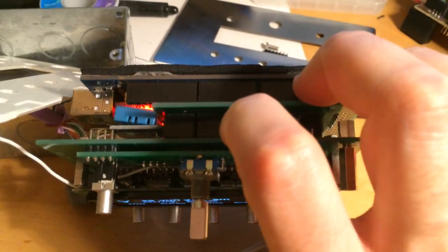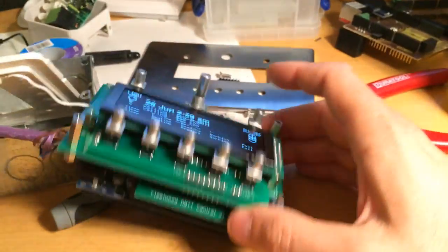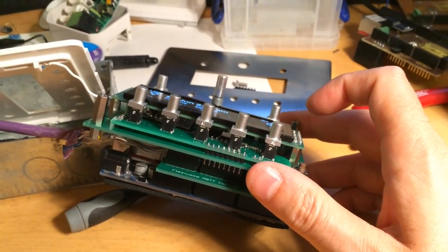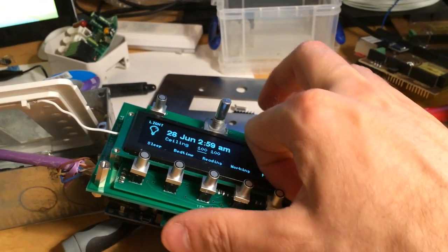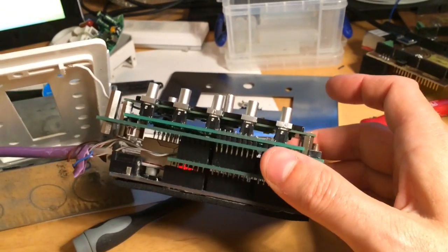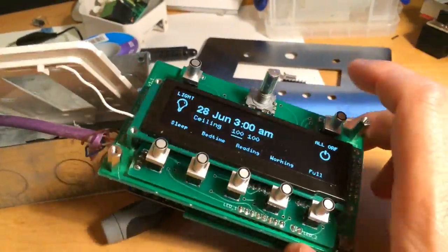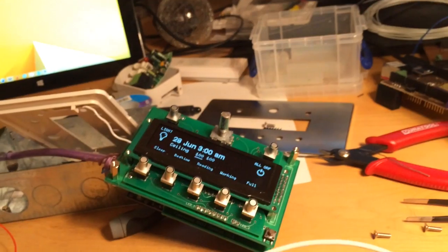There's some kind of ability to put in some kind of auto temperature cutout thing there in case the thing burns down or gets too hot. I don't think it will, because we've only got this buck converter in here, which is getting slightly warm, running at kind of 96% efficiency, and then this LM1117, which doesn't really get very hot because we're not driving it very hard at all. This display doesn't get hot at all. It's completely cool to touch, and those are the only things that get hot. But I'm a bit of a paranoid person, so I put that in because I wanted to know if this thing goes above 30 degrees or something crazy. So that's it. That's the system, the whole thing.